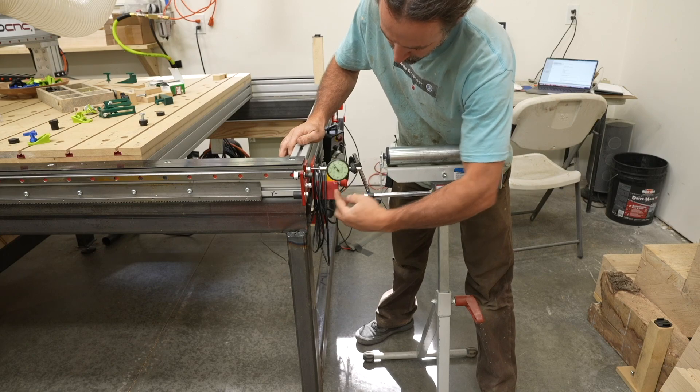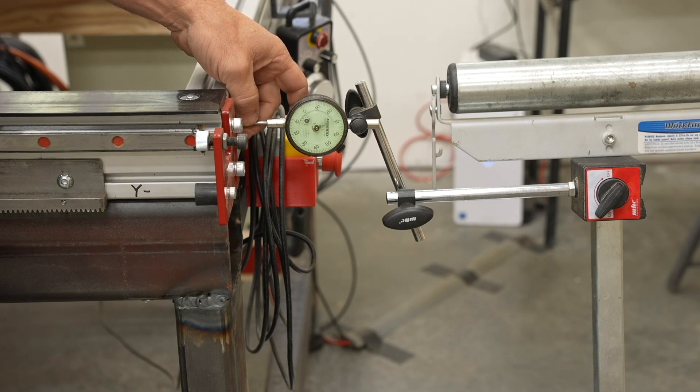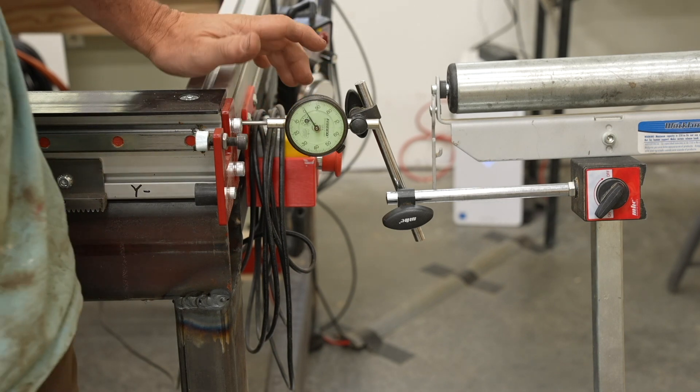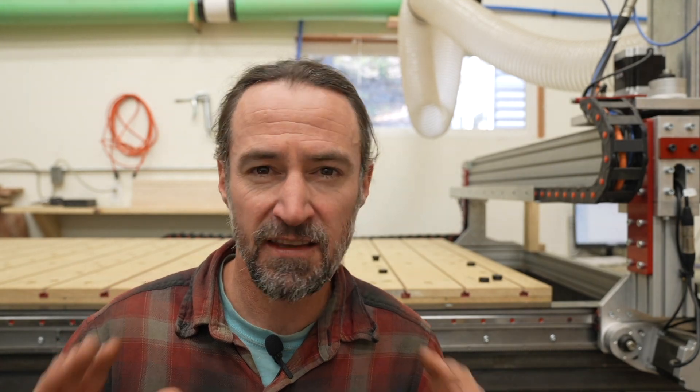This is my plan to test the amount of actual flex I'm getting. The table moves, it'll move my dial indicator and I can find out how far it's flexing. I did a lot of air test cuts to figure out what would cause my table to move the most, and what I settled on is a pocket I created in Vectric VCarve where it moves along the y-axis really quickly back and forth about half an inch. During the test I could see the dial indicator moving up to about ten thousandths of an inch during the air cut, and up to almost seventeen thousandths of an inch during the rapid movements. These are the numbers I'm looking to improve.